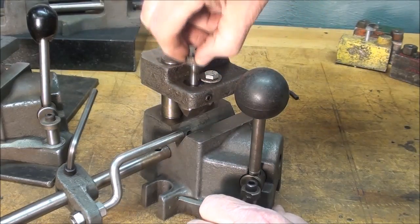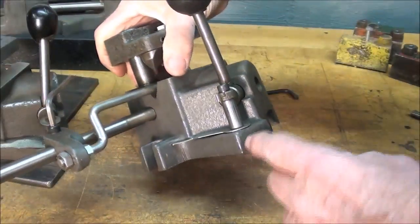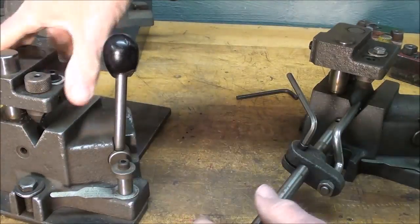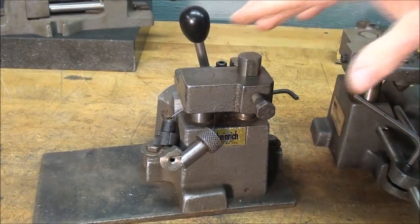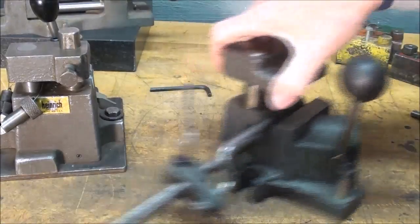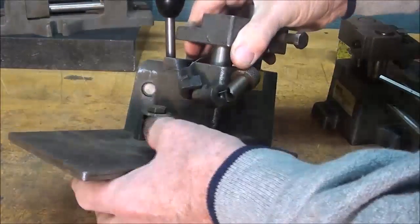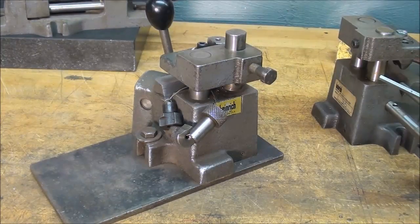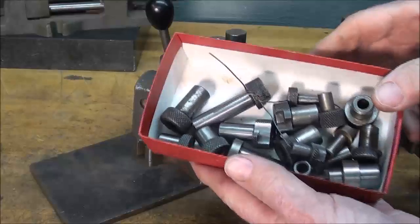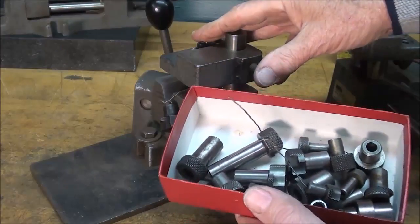It comes with a liner — this is a drill bushing, that's the liner — and it comes with an extra one stored down here. I've had this mounted on a steel plate for years because for general use you really need to hold this down with T-bolts, and I don't like to do that when I'm only drilling one or two holes. So I always had this mounted on a steel plate so I could C-clamp it onto the drill press table. Sometimes I keep my extra bushings hanging here in the common sizes. They have to be the correct size for the liner, the drill size, and the length as well.